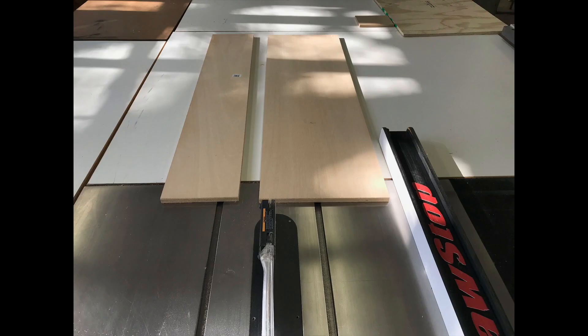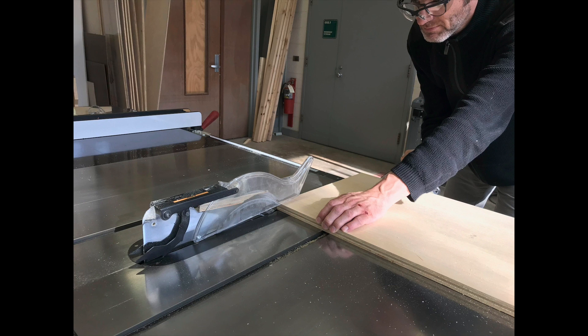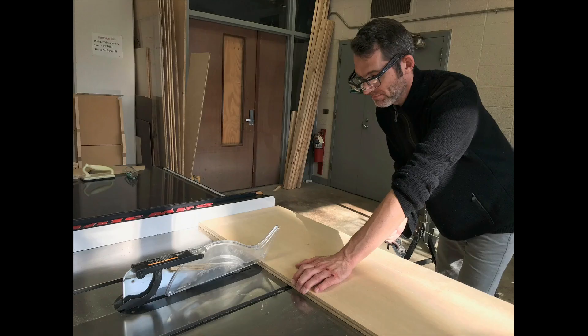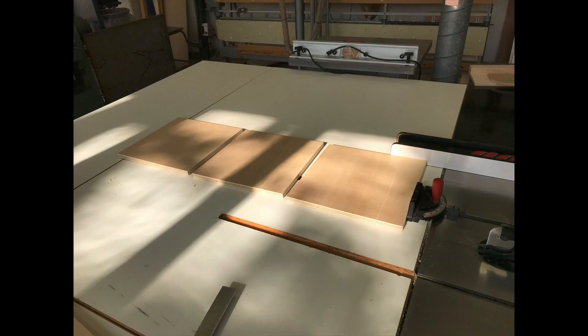I'm cutting a 15-inch long slot. The rip fence on the right I don't move, I leave it. But I will use now the miter guard with a 90 degree angle and do a clean cut just along that edge again. I verify — did I do a good cut? My two cuts are 90 degrees. So now I will pass this board three times through it, so that I have all my four 15 by 15 inch boards.